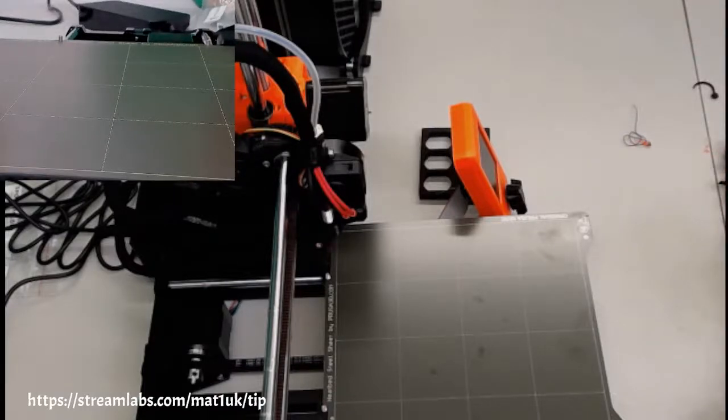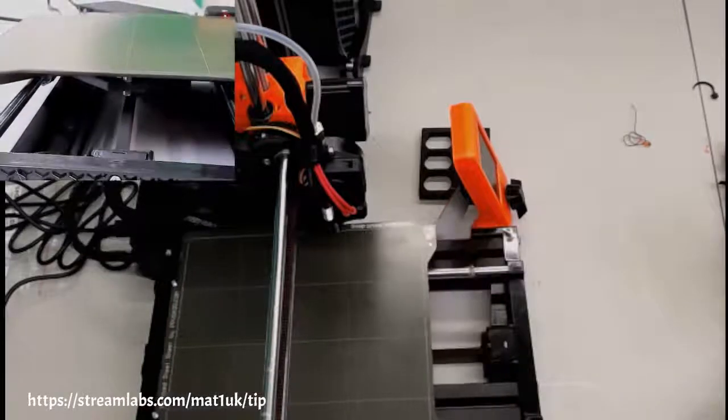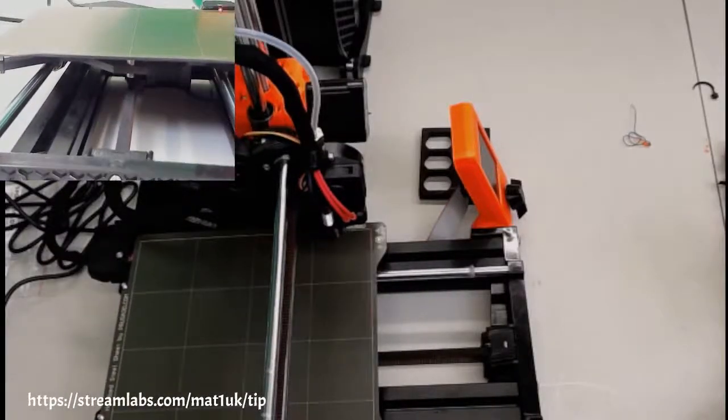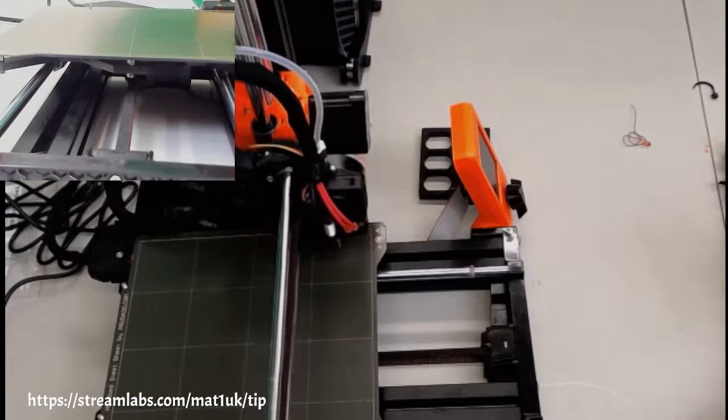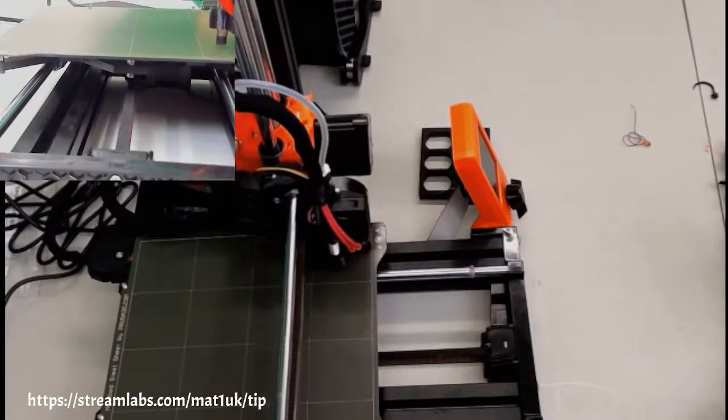I see, as RJ says, typically a printer can print up to about 45 degrees, no problem, but cooling, print speed, etc. become more important when the angle becomes shallower. Also, you have to make sure that you have your model set in such a way that at that 45 degree angle, it's getting enough cooling, because you can actually block the path of the airflow with the way you have the part on the bed.